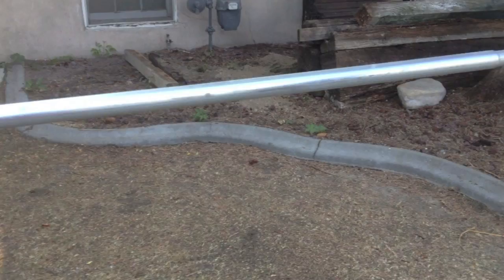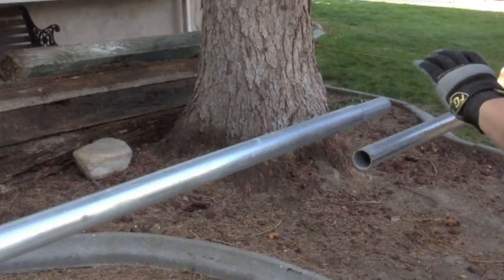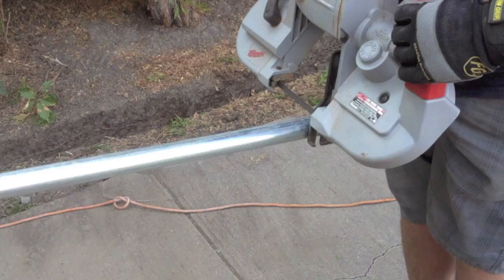The smooth side goes into the top rail. You'll have a swedge so they just joint together. It's very simple to join the top rail. Measure from the inside of the cap to the swedge and make your cut. It's easiest to cut pipe with a portable bandsaw.